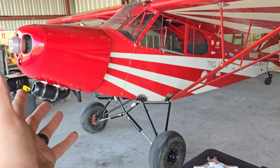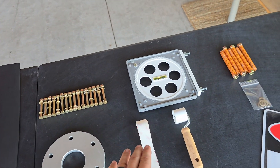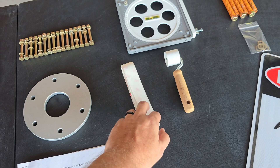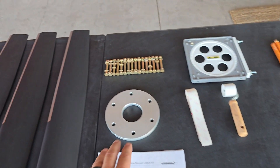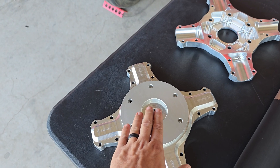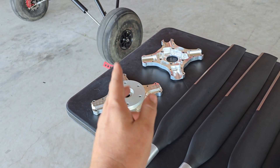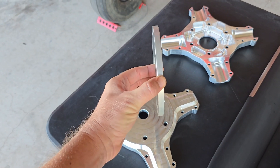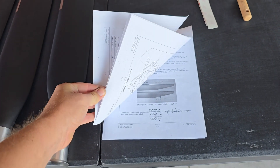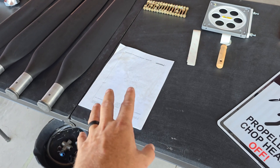Carbon fiber with a nickel-plated leading edge — these are going to be perfect for the red rocket and match the madness it truly is. Coming with the kit is all of the hardware we need, including a tool for setting the pitch since it is ground adjustable. It also comes with clear leading edge stickers with a roller, and a plate for the front of the hub. This does not come with the kit because you need different sizes depending on your application. For my high-horsepower setup I needed three-eighths, which we learned from the manual included in the kit — definitely read through it first.